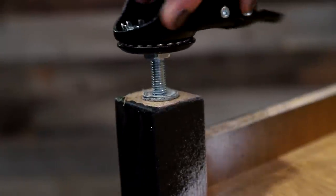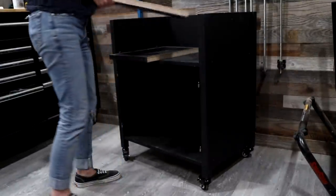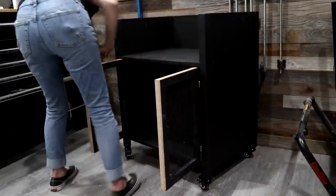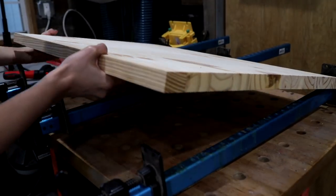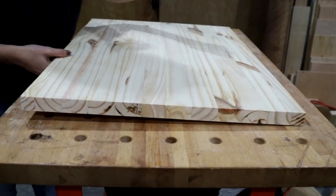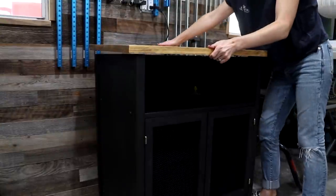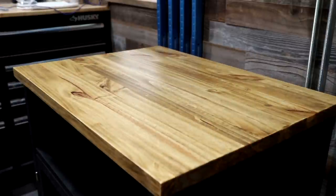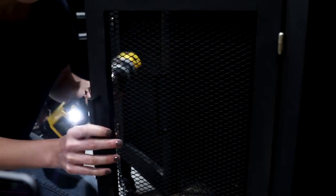For finishing touches, I replaced all the caster wheels on the bottom with black industrial-looking ones. I recycled the original hinges, fit them as needed, and touched them up with a little paint once they fit perfectly. Once the top was dry I removed it from the clamps, sanded it flat, and stained it in a golden oak color, then sealed it with walrus oil wood finish. Last up was adding brand new sleek black modern cabinet pulls — and we have ourselves a thrift flip.